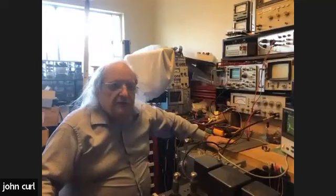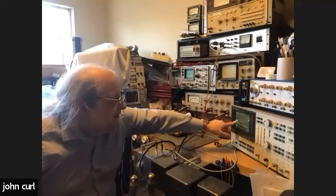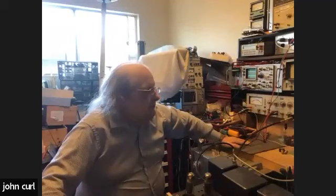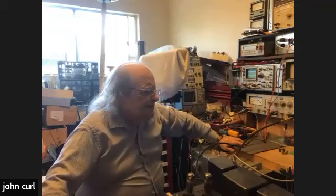Right here, I can see wherever this residual was before. I haven't changed the machinery, so it's locked in from a previous measurement. And it is not really off the scale, but that's 100,000 times down from the original test tone. So it's not much. And the human ear, after a while, gives up. But when you have the distortion out in the outer regions out here, that's when, boy, I'll tell you, it doesn't take much. The ear seems to pick it up and says it kind of sounds a little edgy and so forth.